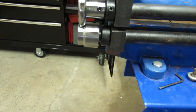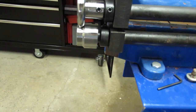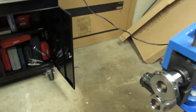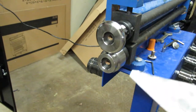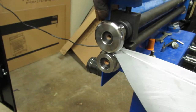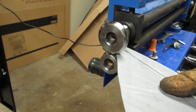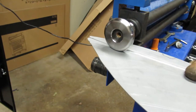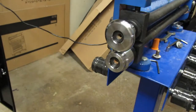I'm going to try one more addition to this video before we wrap up. I've got a half-inch tipping die plus a lower forming die. When you look in the little instruction booklet, this is an undocumented combination. We'll see what happens. The hardest part is always getting the machine to bite on the piece of metal. I'll put it through like this — especially with it being kind of round, I don't want to get my fingers run through there. We'll do a pretty modest first pass.